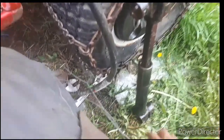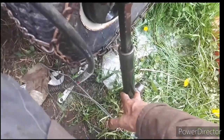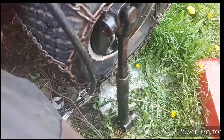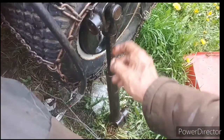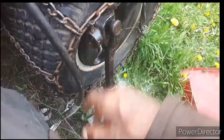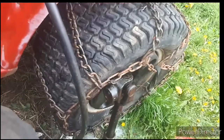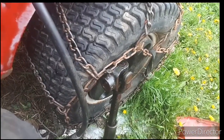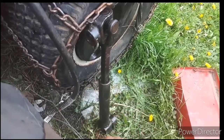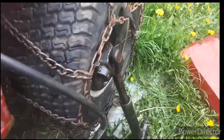use the forklift. I put a 3/8 grade 70 chain around this end, and a 3/8 to the frame of the forklift carrier. And I used a 3/8 grade 70 chain from here up onto the forks. And I pulled slowly on it, pulled and pulled and pulled, and slowly watched for it to move, and it wasn't moving. And I kept tapping the lever to give it a little more pull, a little more pull, and pow! I snapped a 3/8 grade 70 chain.